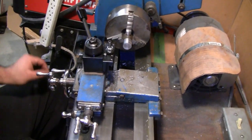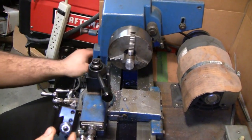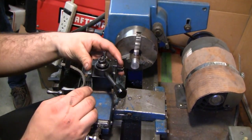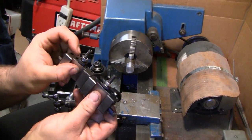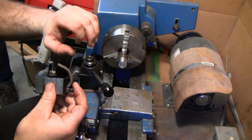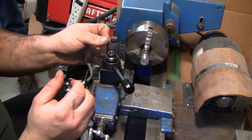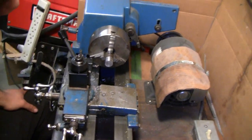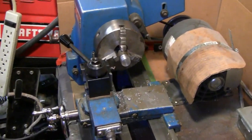Now to change that — show them how you take that bit out. You just pull the handle, pop that out. Put the tool back in — you can put the turning tool on the side here. Look at that. We know this one is level. I should mention that these have little stops here — the little thumb nuts. Those are your stops. The first time you use them you have to adjust them; after that it's clear sailing. Yeah, after that you really don't have to mess with it, unless of course you change whatever tool you're using itself. But the holders don't need to be changed really. So I'd say it's worth the money Mike. It serves a purpose — makes it easier anyway.